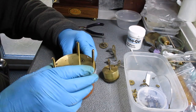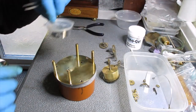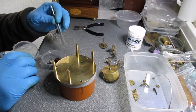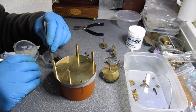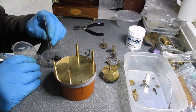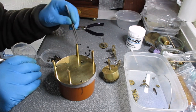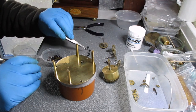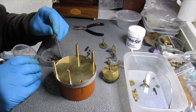It's time to put the Youngs back together. I've done a fair bit of cleaning, pegged all the bushes, given it a coat of wax. I normally wax the movement and lacquer most of the other things. As you can see I've polished the screws and blued them. Just finding the washers out and putting it back together.